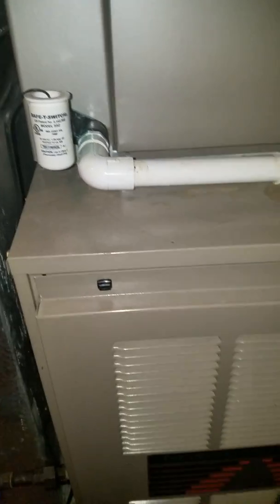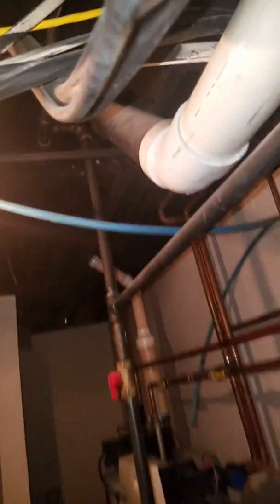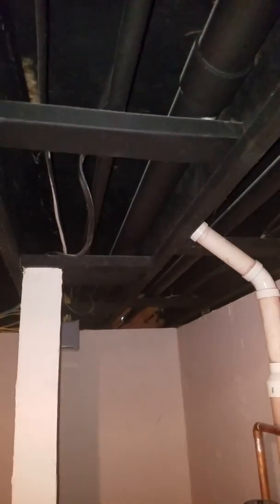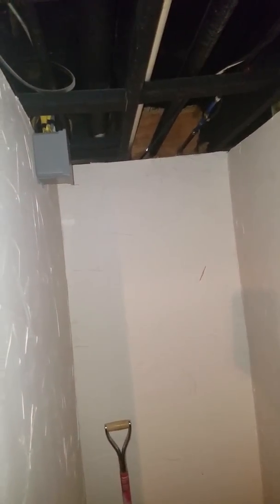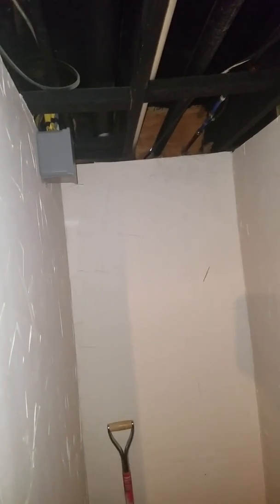The furnace is a 1997 and it is a one-pipe system coming out of the right as a three-inch pipe, then going — as we follow this, it's been painted black. You can still see it going out the side of the house, basically to the end at the back. So it's a one-pipe system going all the way from here on up and out.